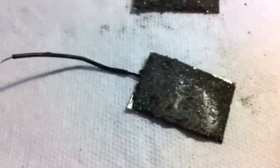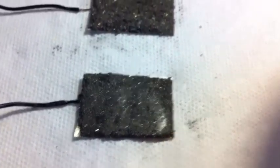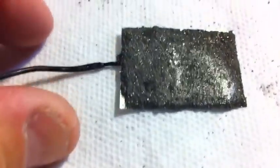I pour — you can still see some of the wetness of the sodium silicate there — and I pour this iron pyrite dust on top of it. This cell is basically carbon, silica, and magnesium surrounded by iron pyrite. My theory is that iron pyrite would protect the magnesium. So I decided to do a base test with a very thin layer of magnesium, which is here.